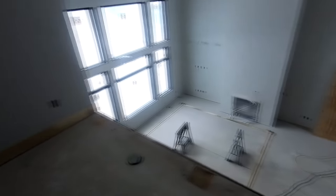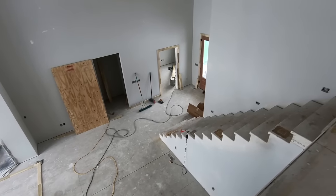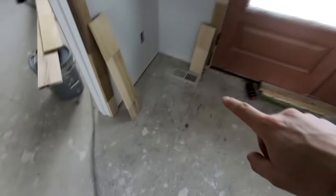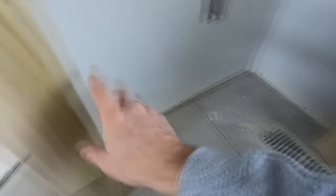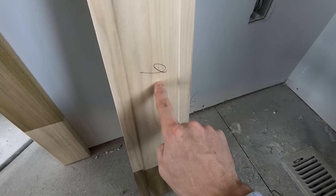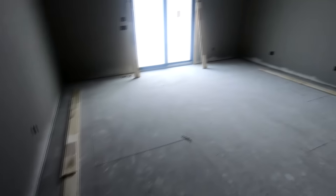I've got this upstairs done and I actually cut the main level base this morning — you see some pieces laying around so that's not nailed on yet. You'll notice each piece has a number written on the wall that corresponds with the number I write on the back of the pieces when cutting them at the saw, making it easy to keep track of pieces and get them where they need to go. I like to cut an entire level at a time — usually about 100 to 150 pieces — scatter them to where they all need to go, then strap up my knee pads and nail them all off at once.